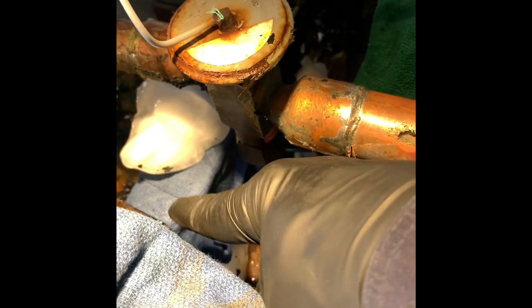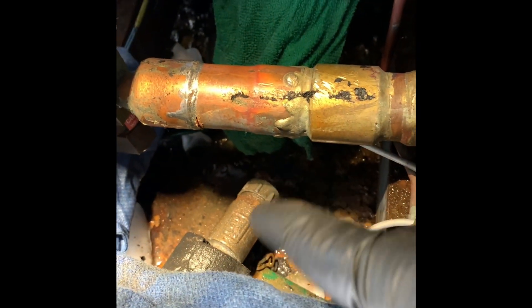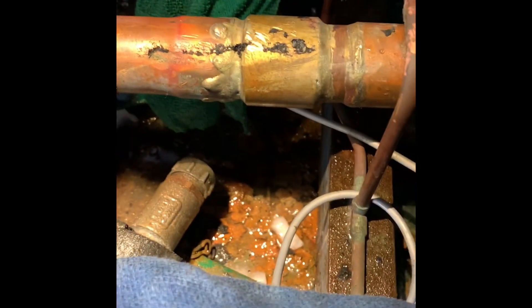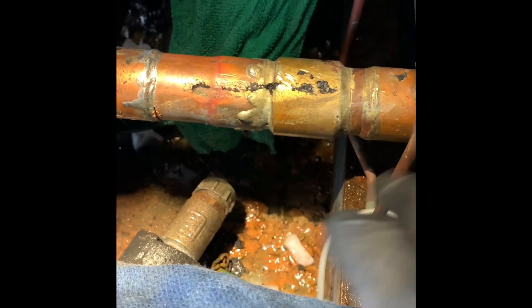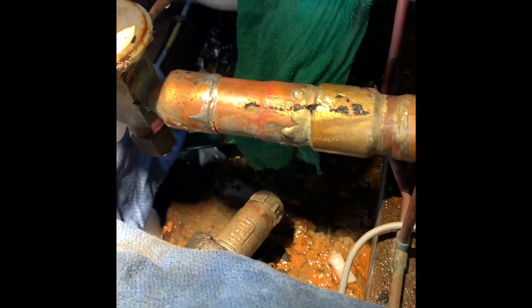You can see I have everything covered up. I've got a valve under here covered up, with a piece of ice on it to keep it wet. I've got a cable under here covered up with a piece of ice on it as well. I'm going to cover that up so it doesn't burn when I start welding. These cables here need to be buried under a rag too. So I'm going to get all of that covered up and set up.